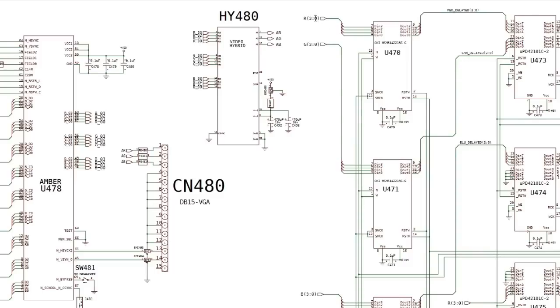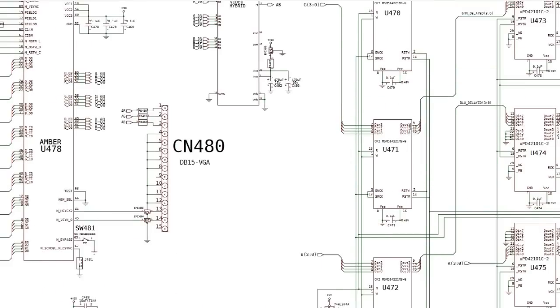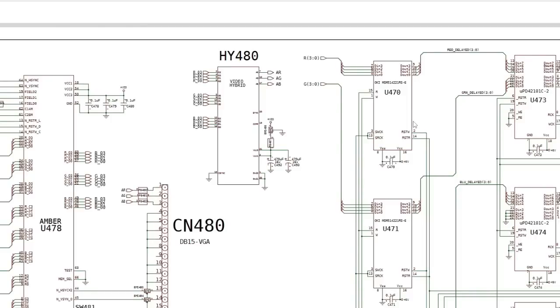So you've got frame RAM, which holds a complete frame of data. Because what is this? It's a de-interlacer, isn't it? If something is de-interlaced, it's a full progressive set of scan lines. You may have, let's just say for argument's sake, 640 by 400. I don't know whether that's the resolution it uses. It probably is. But if you've got 400 scan lines, and all of those are displayed on your TV in a single frame, that's progressive.